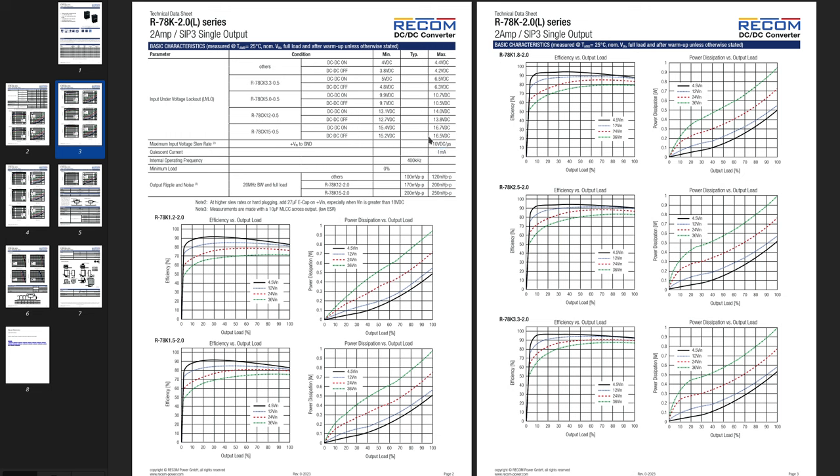I think that 7805 could take more current, I'm not so sure now. Internal operating frequency 400 kHz. That's a lot, and any high frequency noise can be easily clamped with some tens of nanofarad filter cap.